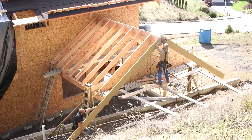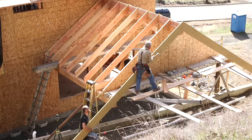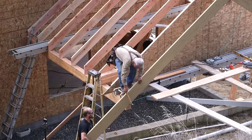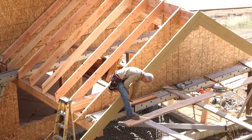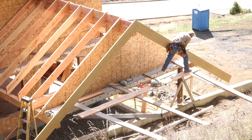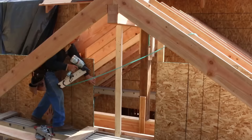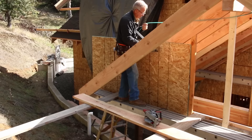You're going to be seeing these aluminum bridge planks a lot as we work around the exterior of this house — they are so handy. One is 20 feet long and 12 inches wide; the other is 24 feet long and 16 inches wide. They're kind of heavy and unwieldy to move around, but once they're in place they allow us to create a very stable, long work platform in a short amount of time. You don't always need a full scaffolding setup to get the work done — a lot of times you just need a place to stand. Trying to do this job on a ladder would be slow and risky since there's no stable level ground to set it on and I need to move back and forth a lot. It's almost always worth the time and effort to build shoring and platforms, and it is safer by a wide margin.